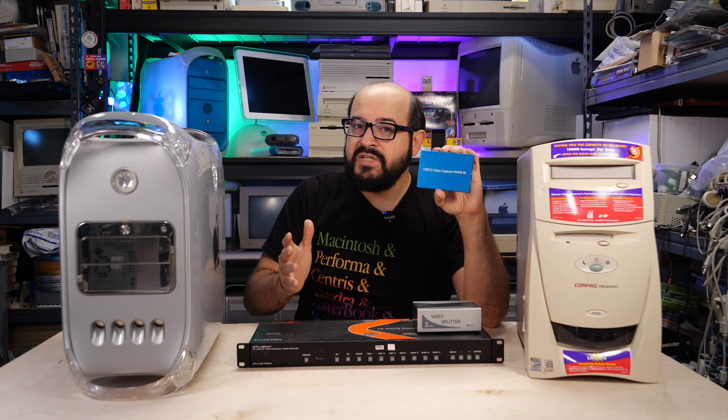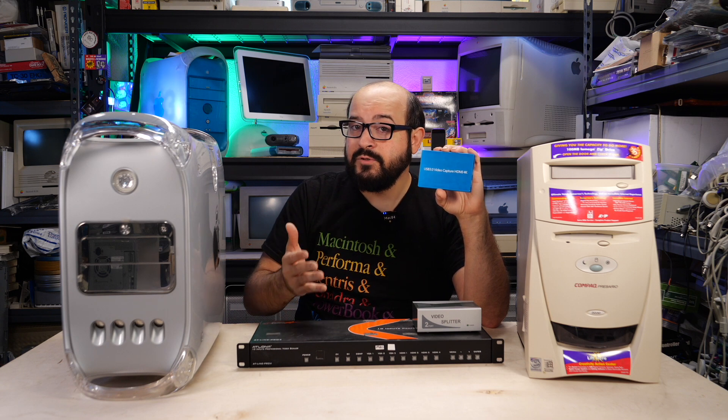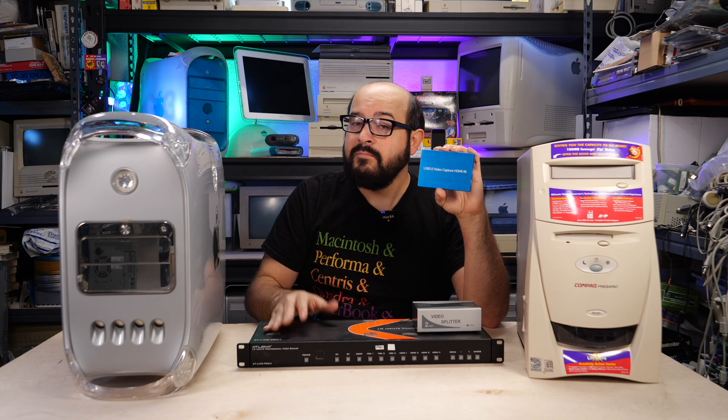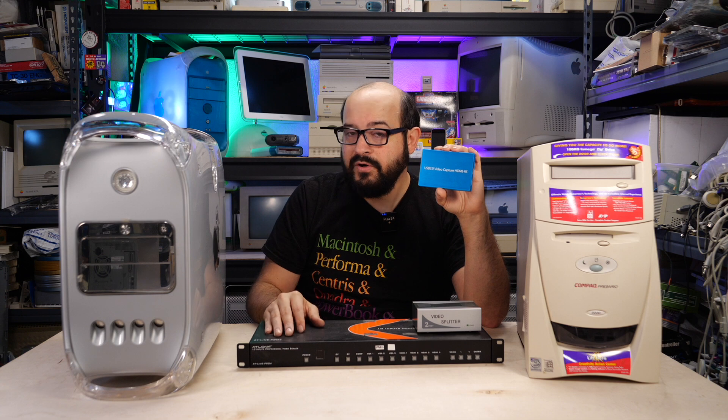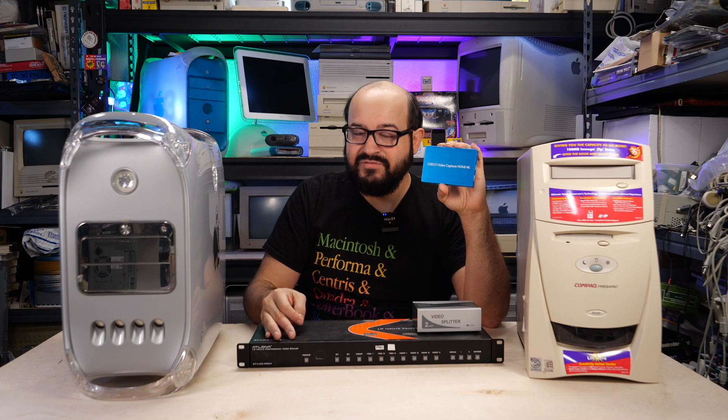You may need other amplification if you're plugging a line-level thing into that microphone port, but keep in mind that VGA is a video signal — it does not carry audio. So if you want to capture the audio from your PC or other device, you will have to figure that out because some scalers do not support audio. Thankfully capturing external audio is much easier, and there are a lot of solutions and splitters out there if you need them.